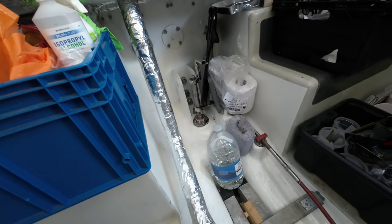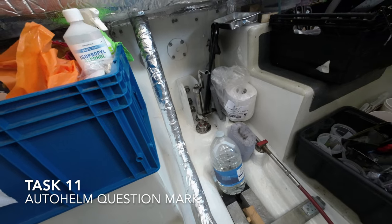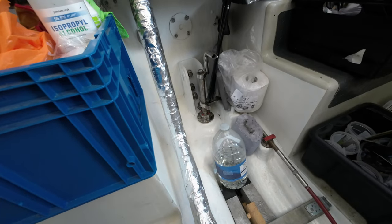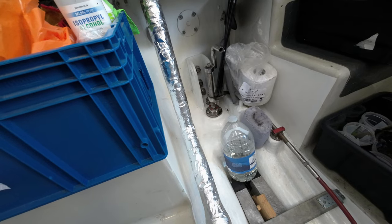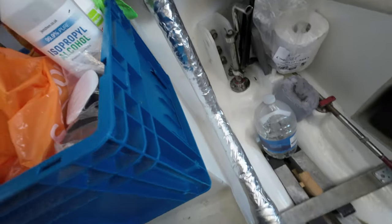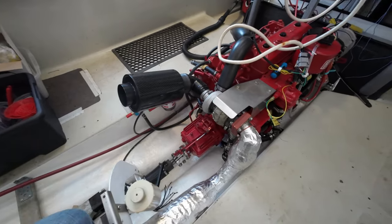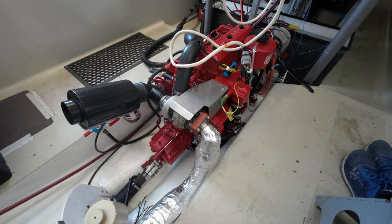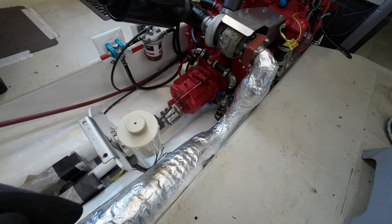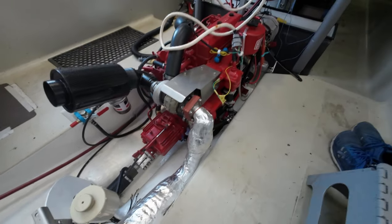I'm as yet unsure about auto helm — some of it will come down to budget, some to practicality. But we have quite a straightforward steering system here with a big tiller mount, so it would be fairly easy to install one. Maybe some of you with experience of that can share some ideas. The exhaust is still here — good news. The engine is pretty much good to go. I've been checking for coolant leaks over the previous weeks; there was one tiny one about a month ago but I've tightened the hoses and that now seems completely resolved.